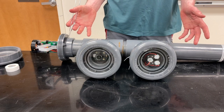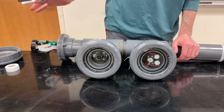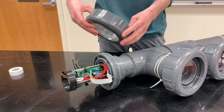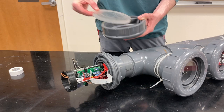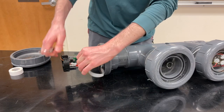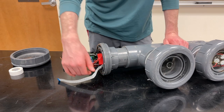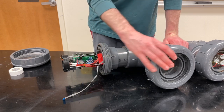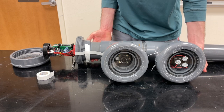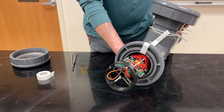This camera just got back from a deployment, so I'm going to disassemble it as I would in the field. Initially I take off the union joint and the plexiglass covering this port, then I'm ready to pull the whole system out. Now I remove the ribbon cable — it pops right off the Raspberry Pi 3B+ — and as I pull the system out the camera is no longer connected. I tape the ribbon cable against the housing so it's out of the way.